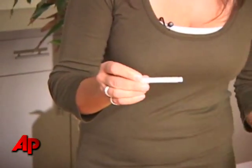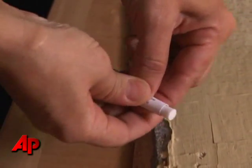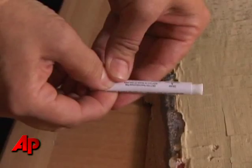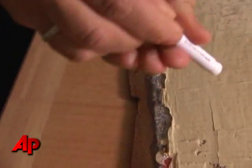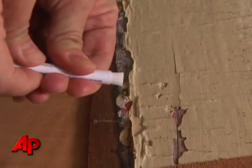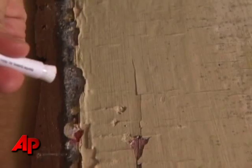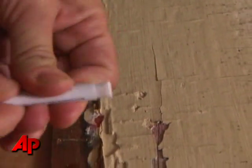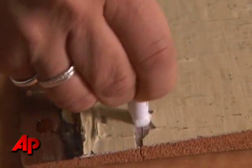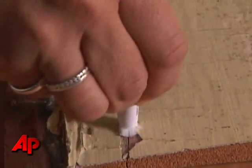You take one of these little vials, and it's got two little places where you crush it. Let me just do that — I can do that with my fingers, one here and one here. And that mixes some chemicals together. Then you try and get some yellowish liquid to come out of the end — it's a little bit messy. And once you have that, you take the yellow liquid and you rub it on the spot that you think might have lead paint.